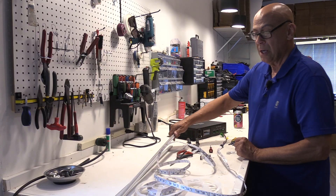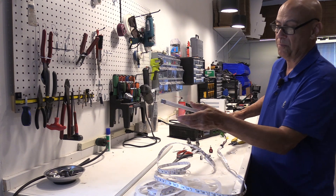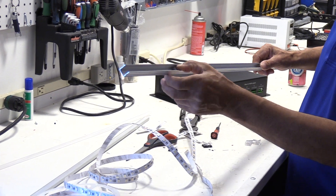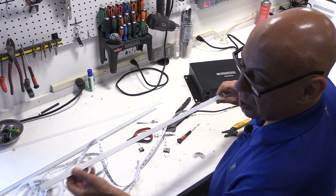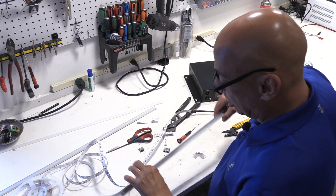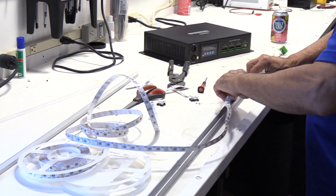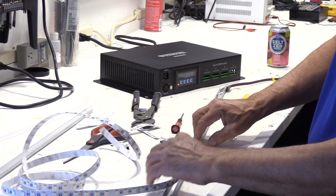The same rules apply with your 90-degree connector. We also offer this really beautiful aluminum channel. You can take the diffuser off. I don't recommend using screws directly in the channel because the bumps can affect the tape, but if you use a good two-way tape on the back, you can use a very tiny screw with a small head just to secure it. Just lay your tape inside. You can use 3M adhesive — I do like using the tape, don't you Chris? It keeps it completely even all the way to the bottom of the channel.